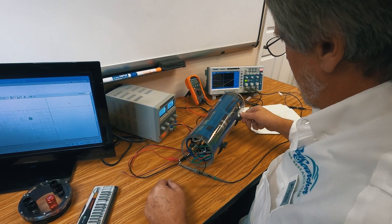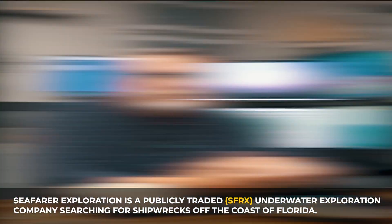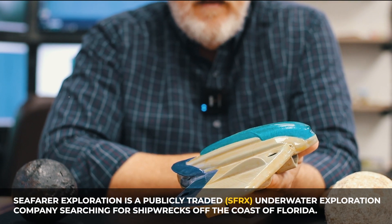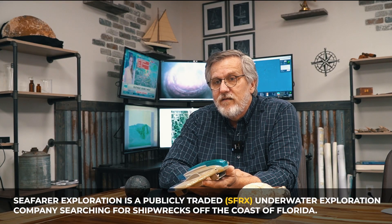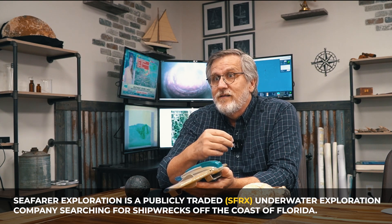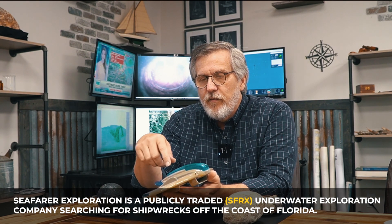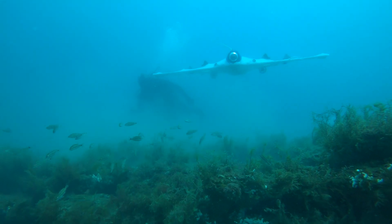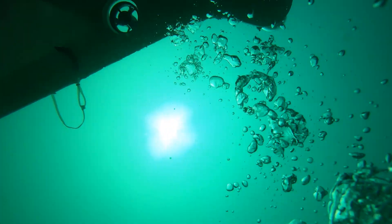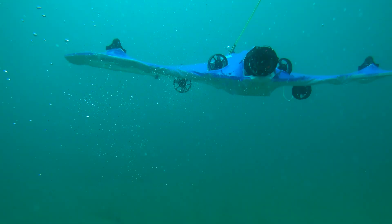So we designed a specific sonar to both image and locate objects below the ocean floor. The SeaSearcher sonar, which is located all the way around the perimeter of the SeaSearcher, is designed much like the eyes on your head — we can tell the distance of an object and whether it's round or square, because we have two eyes, which is called binocular vision. In the case of the SeaSearcher, it's multi-vision: there are multiple sensors around the perimeter. As it's flying along above the ocean floor, the sonar looks deep into the ocean floor, and the sensors use what we call aperture — the spatial change between sensors — to get a three-dimensional picture of whatever is buried below.